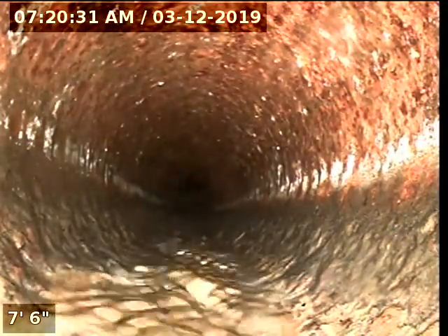The purpose of this inspection is to determine the overall condition of the sewer lateral for this property to the city main — to determine if there are any cracks, holes, root intrusions, offset joints, or any bellies in the line retaining water.